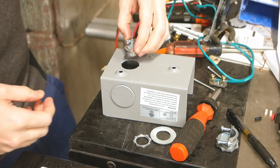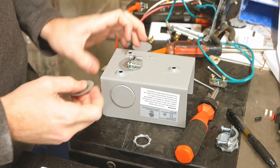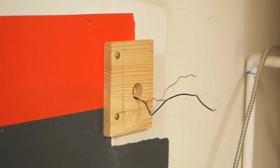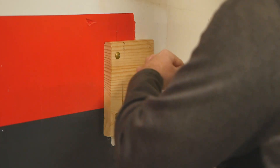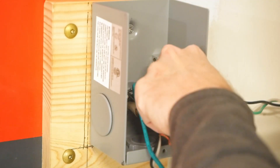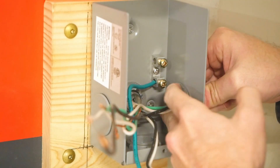This box is pre-punched with three-quarter inch knockouts, but most likely you'll be using fittings made for half-inch ones. Reducer bushings are cheap and available anywhere electrical fittings are sold. Since I'm bringing the in-wall Romex into the back of the box I'll use a non-metallic clamp meant for this purpose. Since this will be surface-mounted I had to fabricate a basic mounting plate lagged directly to an adjacent stud. The Romex is fed through and clamped; it's three number-10 screws and we're good to go. I'll use one of the side knockouts to secure the MC cable that feeds power to the furnace, which also requires knockout-reducing washers for the half-inch MC clamp.